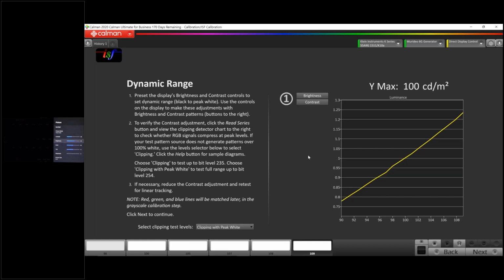Just the way our eyes work. Our eyes are more sensitive to contrast than anything. So if we don't get the contrast right, the whole picture is going to be kind of whacked out. So as I'm getting a little bit lower here in the brightness control, I'm back down to 54, right? And I'm still in that same position. I can see 19, I can barely see 18, I cannot see 17 at all.